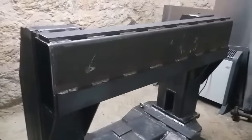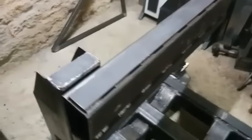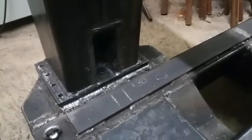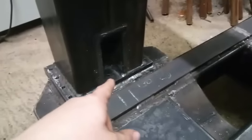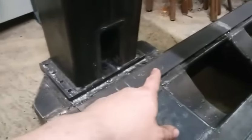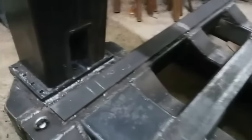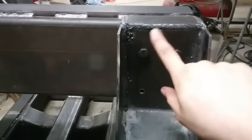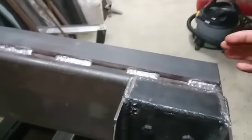All the bars are welded on top. The gantry is now fixed and the legs have been finished. There'll be two large bolts through here — I've got M10s in there at the moment, but they'll probably be M20 by the time I'm finished. They're just in to make sure everything's lined up before I start drilling the rest. There are four M10s front and back on both sides, and then at the back there'll probably be M15s that go through and hold the gantry on. So the gantry is held in by four on the back and another six on the front.